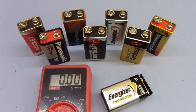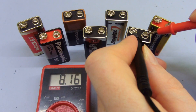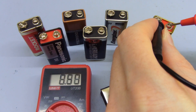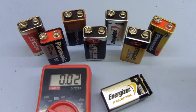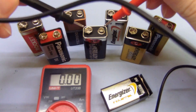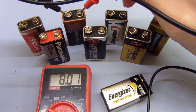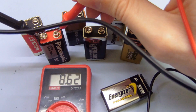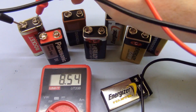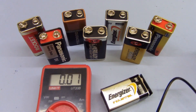You can test the voltage directly — I've got this on the 20 volt range. You can have a look at these things and test the terminals. Straight away we've got 8.1 volts there, 8.8, 8.6, and 9.4 — that one's not bad. Then 8, 9.6 or 8.6 — that one's not too bad either. And 8.8. So they all seem to be roughly 9 volts.